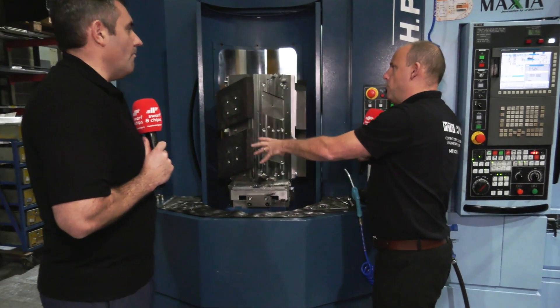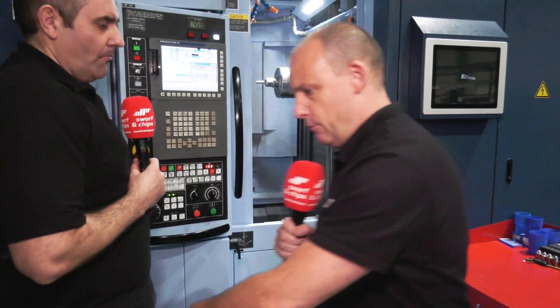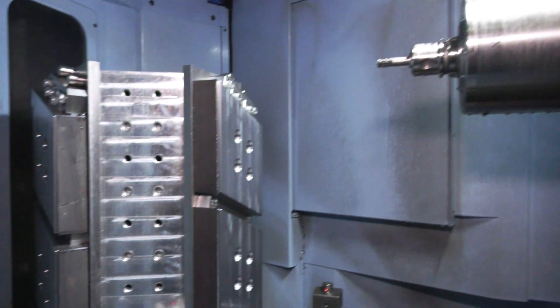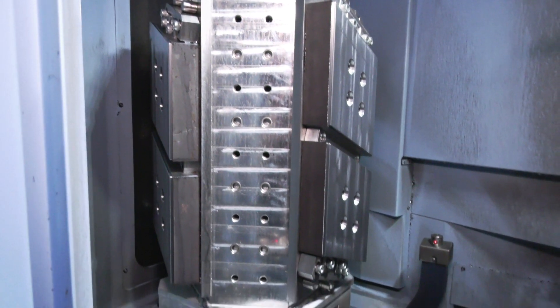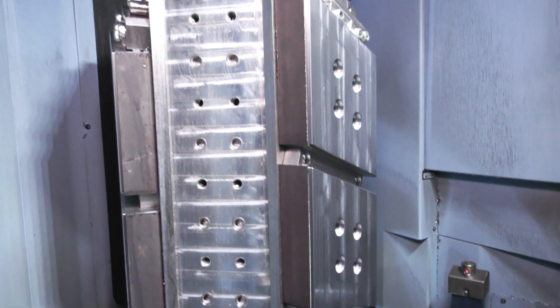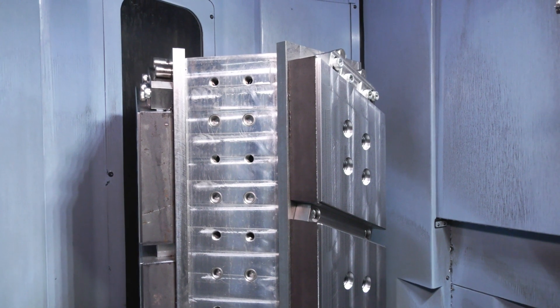So the five faces — you're not getting the full use out of all five faces here yet? It is designed that way, but at the moment because we're proving out, we've got Op 1 in the machine and this is Op 2. Eventually they'll both be Op 1 and Op 2 — the Op 1s will sit here and the Op 2s will be here. The pallet will then have roughly about a three-hour cycle time. That fixture inside is doing Op 1 on the larger face, and eventually that tomb will have 12 pieces — 6 Op 1s and 6 Op 2s — coming off complete.